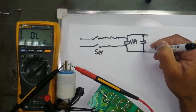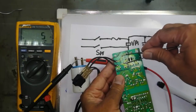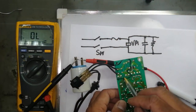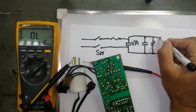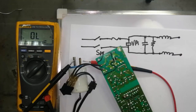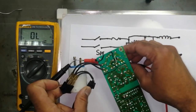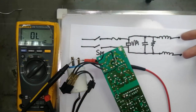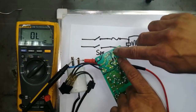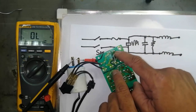After that there is a capacitor and a resistor. If this capacitor is short, you will find a short circuit at the input and the fuse will burn out again and again. After that there is a two-line filter. Sometimes it is open — it does not become short, it just becomes open. When it is open you can find voltage at one point but not at the other. Check voltage here; if you find voltage at the input but not at the output, the problem is the filter.